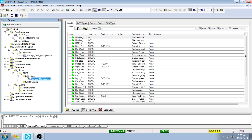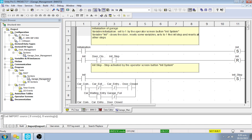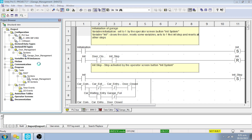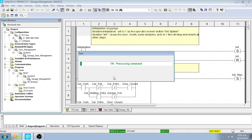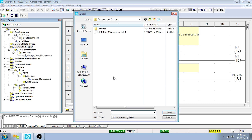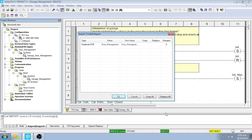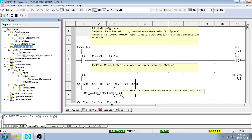To view this section, click on the directory in the project browser. To import the door management DFB, right-click on the Derived FB Types directory and select Import. Click Yes to save changes. On the import dialog box, select the XDB file type and browse to the DFB door management file in the project files. Click Import, then Replace All, and click OK.